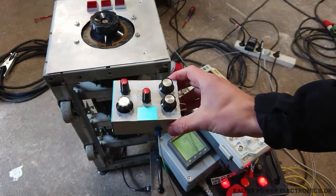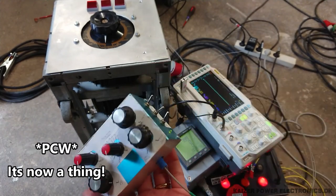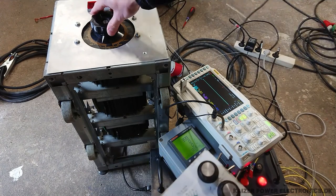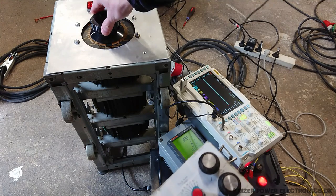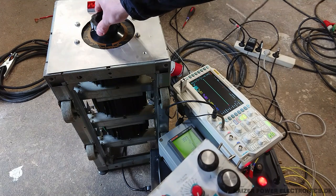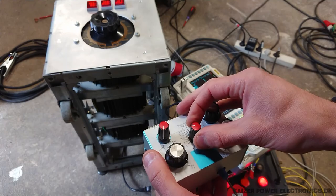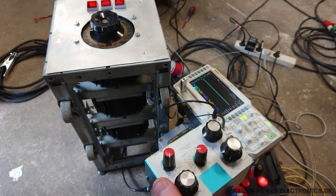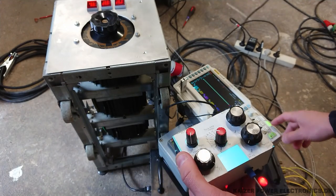I've got the interrupter connected, now sitting at 14 BPS — the lowest possible pulse cycle width. So right now we can turn up the variac. And we start hearing some chattering. Now we can hear it pinging the iron piece over there. Let's see if we can get the trigger ring here on the scope.